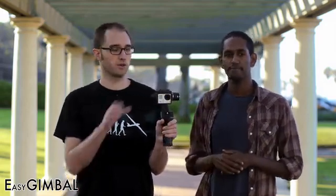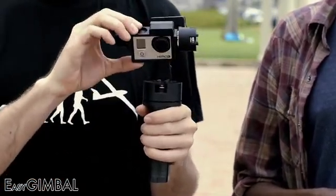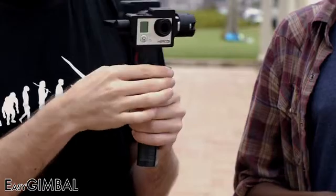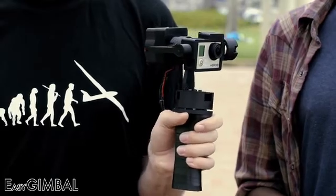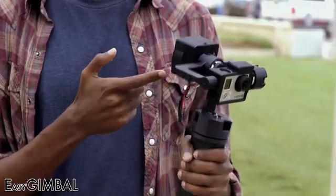This is a 3D printed prototype — the final version will be more polished and compact. You have the electronics in the back that control the three motors. This motor here controls the tilt. This motor here is responsible for the roll. And the motor in the base controls the pan. Together, they work in unison to keep your camera level and steady at all times. If you want to aim the camera at your subject, you simply turn the handle in the desired direction and the camera moves with it. We kept external cables to a bare minimum — there's only a single line of cables running from the electronics in the rear to the base. Changing batteries is simple. The Easy Gimbal uses standard DSLR-type batteries that slide into the grip.